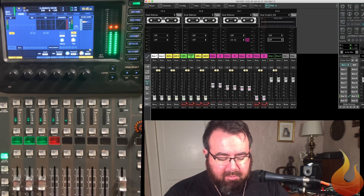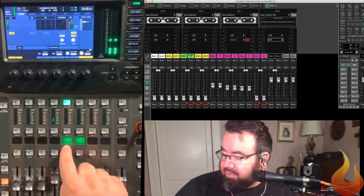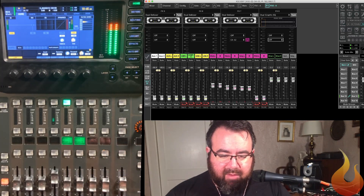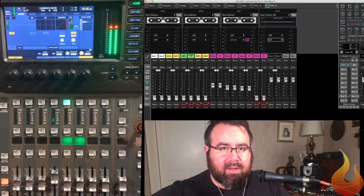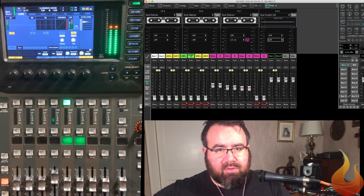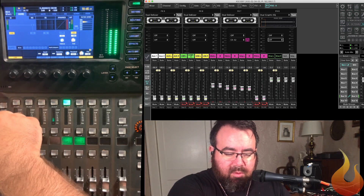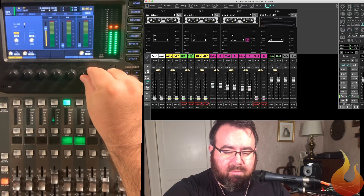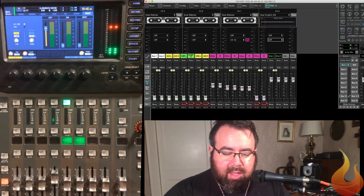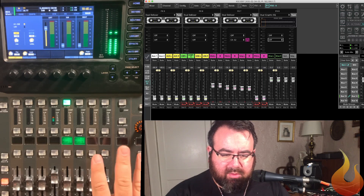So what we're going to do — I'm going to play it back in a moment. We are looking at our broadcast mix, which is on buses 13 and 14. First off, very important: I've got those set exactly at 0.0. In this video, we're going USB out of the console into a computer running OBS, and that's how we're recording everything. The way to check that you have that exactly right is to go to your view button for your master bus and make sure that is set to 0.0 exactly. We're going to put some safety measures in there as well.